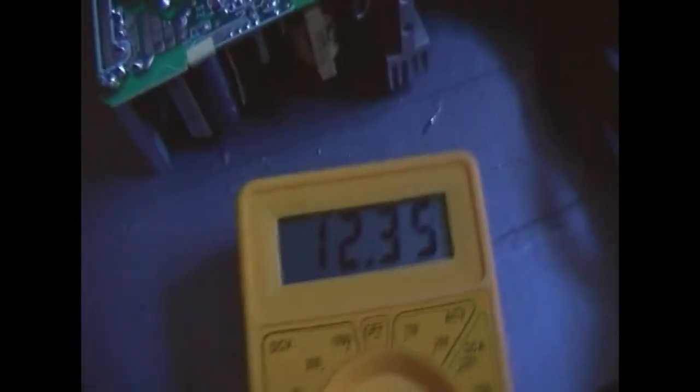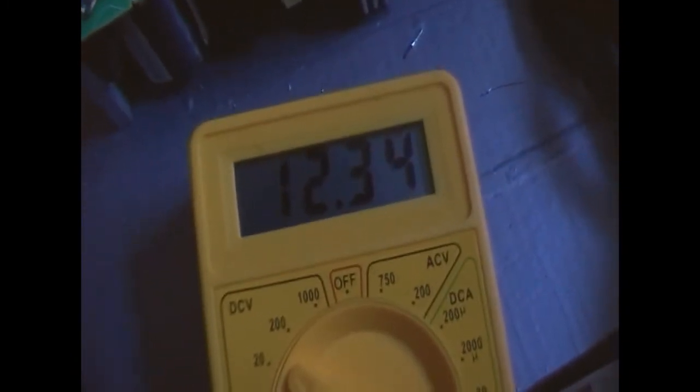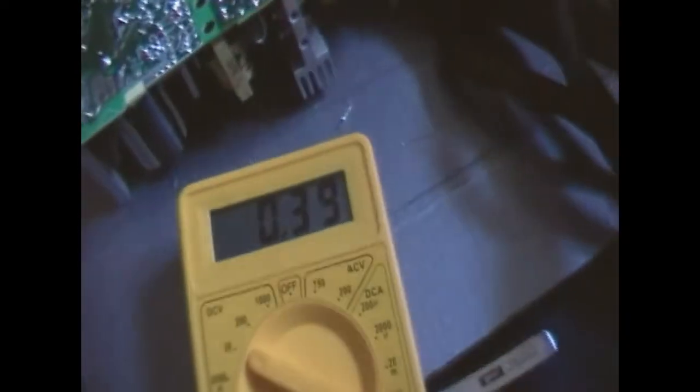Look at that. Compared to like the 0.30 volt ripple before, now I've got very little. It still has that noise, but that's probably because there's no load. It's just restricting on the output. So if I check another rail at the 5 volt, 5 volts now pretty much in spec. It's a bit low, but when the power supply gets loaded it should increase. That's in spec though.